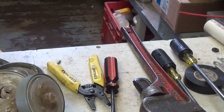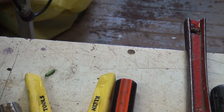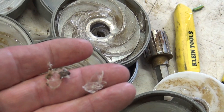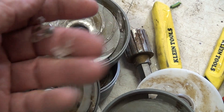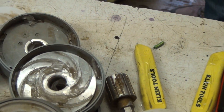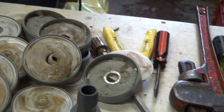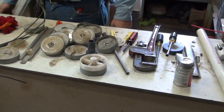Now this little debris here — let's see if I can get the camera on it. Some of these debris pieces are what the customer actually found in the strainers of his faucet heads. That's something I had never realized before, but you can actually diagnose the beginning of a pump problem if you look at the debris in your faucet strainers. That's interesting.